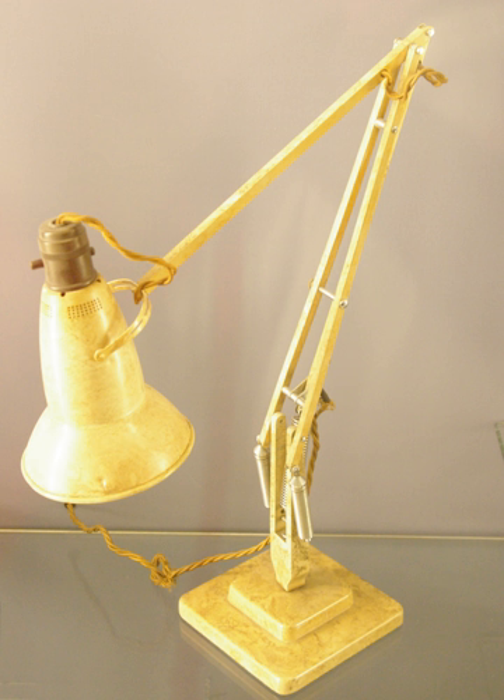Tension spring over wheels: the wheel to control the forearm is smaller than the wheel that controls the upper arm. The lamp cap rotates the same direction as the upper arm and forearm. Two arms, one spring, one toothed wheel: with this technique the tension spring has a double function — it controls both the forearm and the upper arm. This is not a common arm-lamp system.